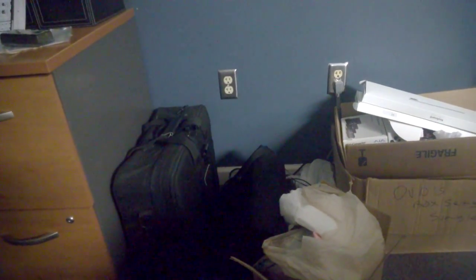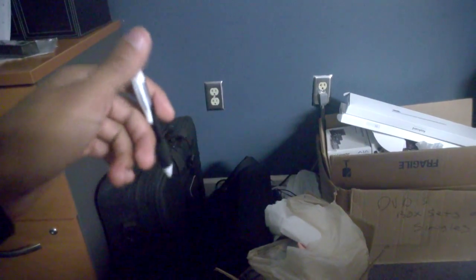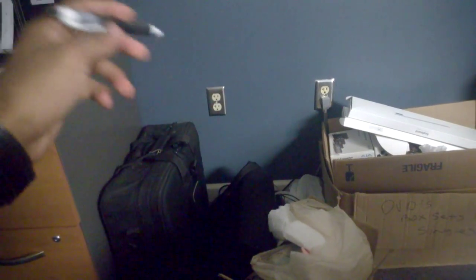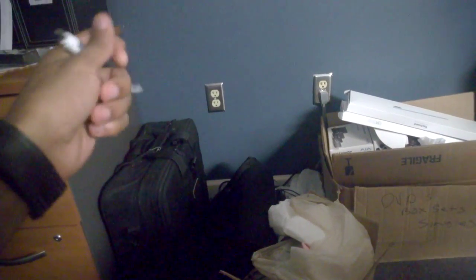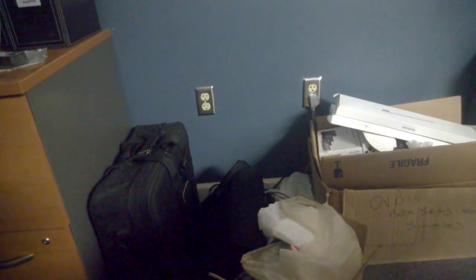And I think that makes sense because you got all kinds of appliances plugged into that one power strip, so it's pulling all of that power. If you were to do it again with another power strip, you're pulling a lot of power that that outlet probably can't manage.